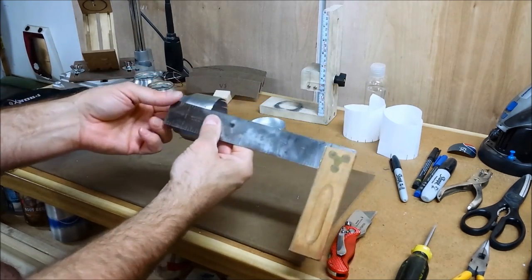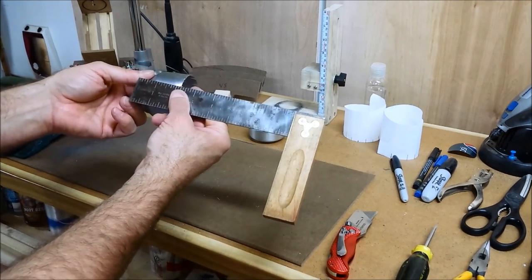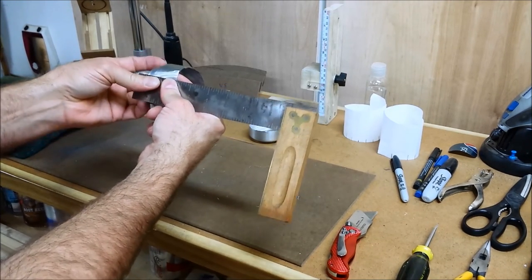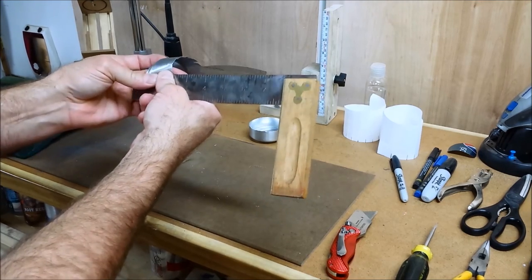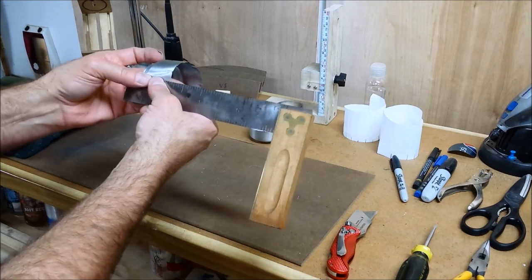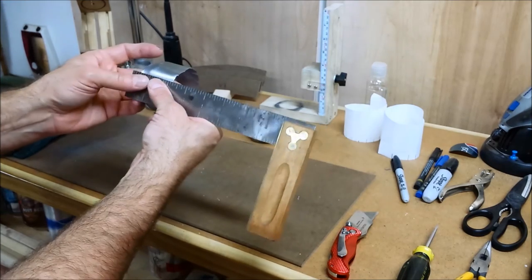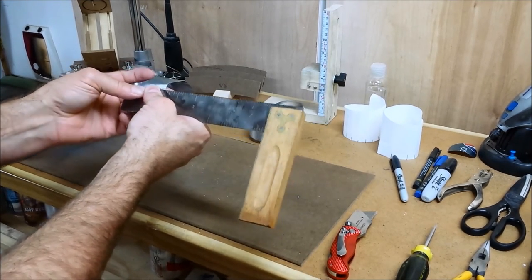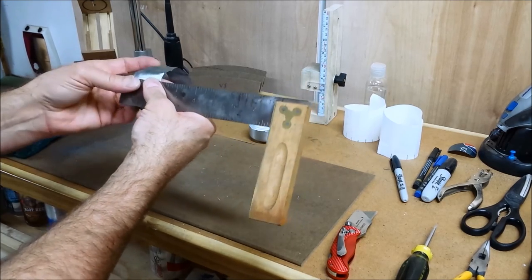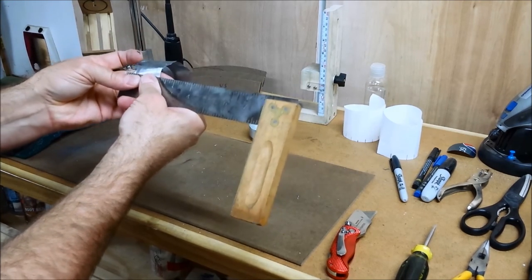I now need to make those grooves. So I need 8 grooves. I'm going to do it at every other slit. Use the metal ruler against the top of the can. And with my fingers on the inside, I'm going to press and make that groove. And it's going to go up and even dent into the shoulder, which is what I want. I'll skip one snip and go to the next one, and that's where I'll make my next groove, my next crease. And I'll do that all the way around the can. So I'll end up with 8 creases for those 16 slits.